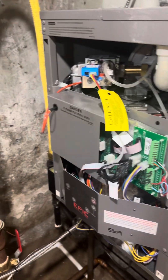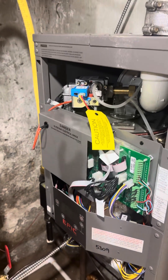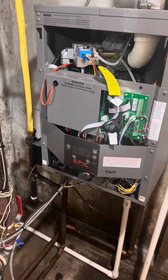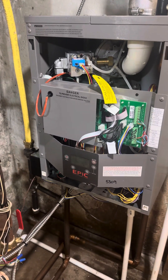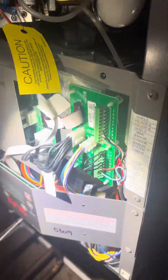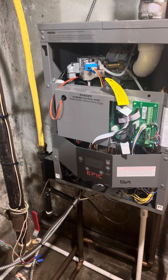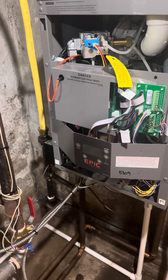The plate going on the bottom is three easy screws — you put it on and then reverse everything you've done. Put the heat exchanger in, start reconnecting the top panel, start reconnecting all your electrical connections. Time frame took me about an hour to an hour and a half. This is the first one I've done — not that big of a deal. It seems a little overwhelming when you have all these connectors to disconnect, but fortunately, as a good manufacturer, those plugs are specific to each one so you really can't mess it up because they only fit in one orientation and in one location.